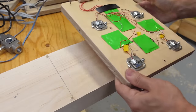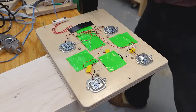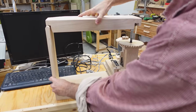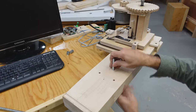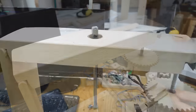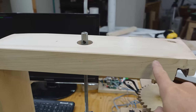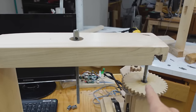These locating pins help me position the screw jack base exactly on here so that the center is right there. These load cells measure the force that the screw jack applies. Now I need some holes here and here to pull from. This bolt can pivot in here a little bit, and I even rounded it to make sure it pivots nicely in the middle. The depth of that hole is such that it's in line with this, to make sure that this lever always doubles the force of the jack onto this bolt.